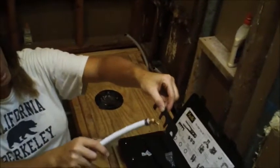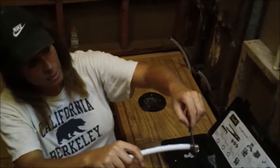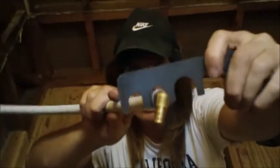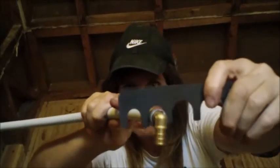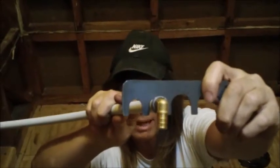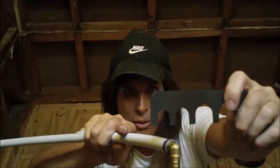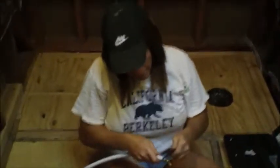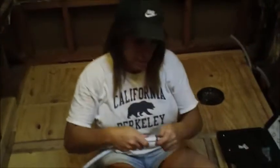How do you know you've made a good connection? The kit includes a go and no-go gauge. All you do is slip it over the top of the fitting — it has markings for three-eighths, half, three-quarter, and one inch. Slide it on: if you can see a little bit of light between the gauge and the fitting, that's a go. If it goes all the way up with no light, or won't fit at all, it's a no-go. This was a perfect connection — a go.